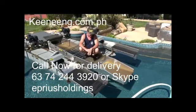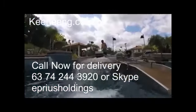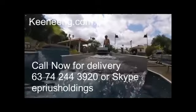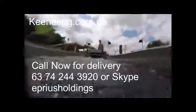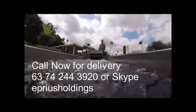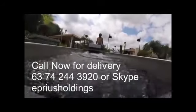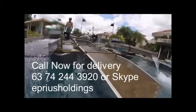Gold I've never seen in my lifetime. That kind of covers the basic sluice. Really, the bulk of the material going through here is going to be 500 mesh silt and sand, and not much stuff bigger than sand. Because in a gold recovery system, the sluice box is going to catch all the visible gold — probably everything down to close to 100 mesh — and you'll lose some of the finer stuff.